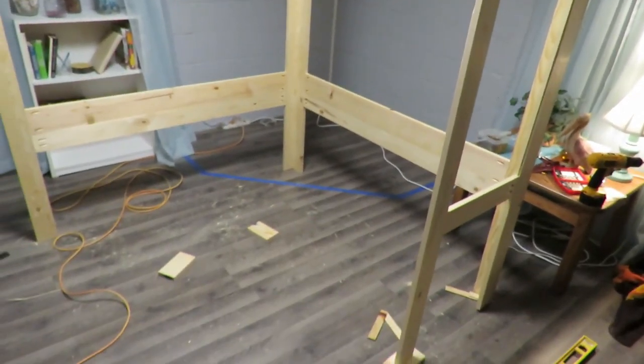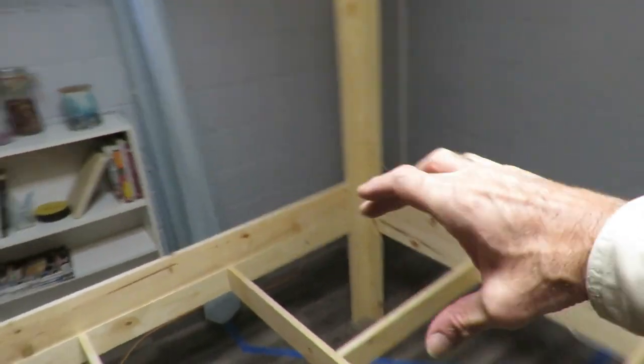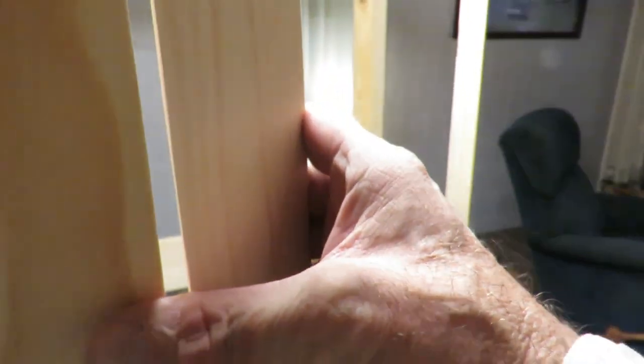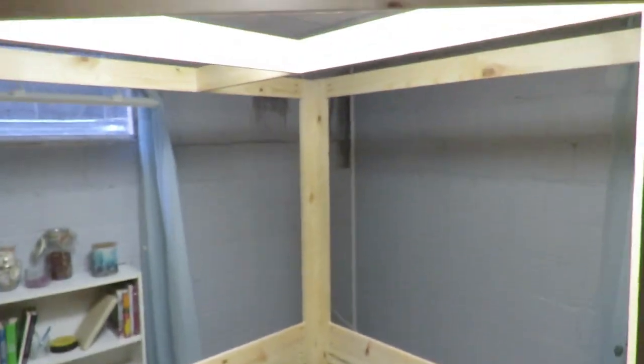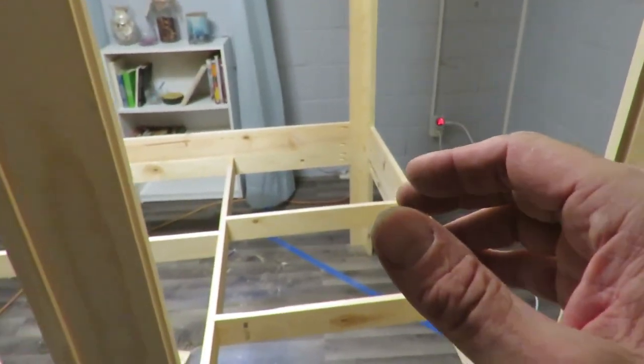It's gonna sit back in that corner — it's kind of a fun project and I'm slowly getting it together. Basically working on this piece and this L-shape first, got it all squared in. This one here was a little tricky — I had to run that through and cut an angle on that board so that this will snug in like this. This is going to be the front portion right here. It's six feet tall, five feet from the corner in both directions, the ends are two feet out, and there will be two doors over here so I can access it.